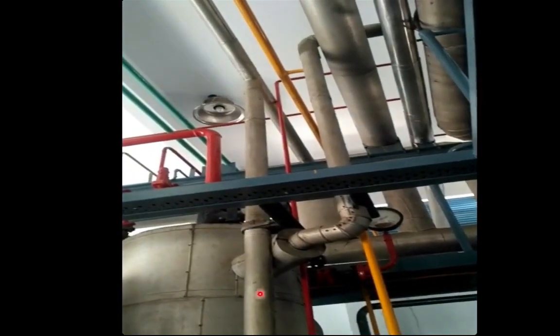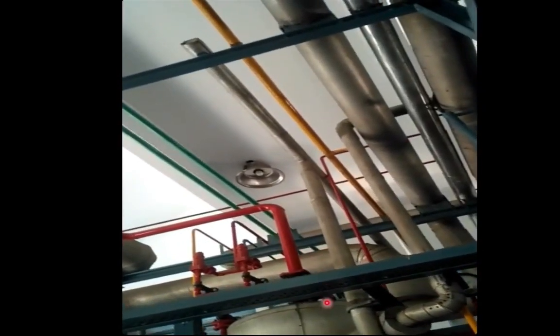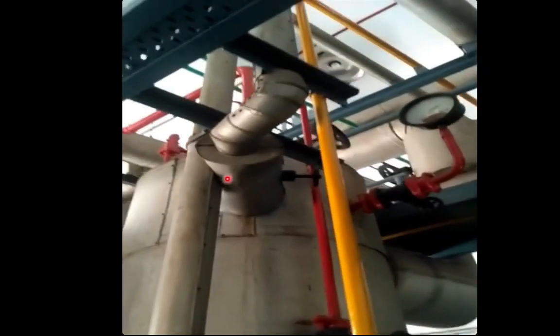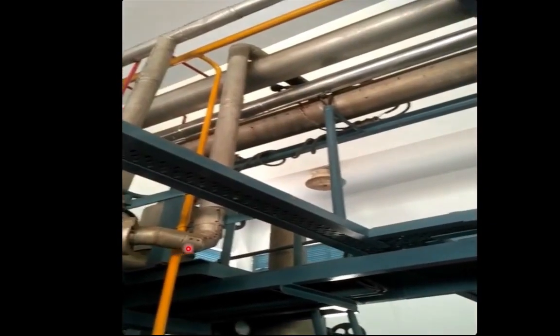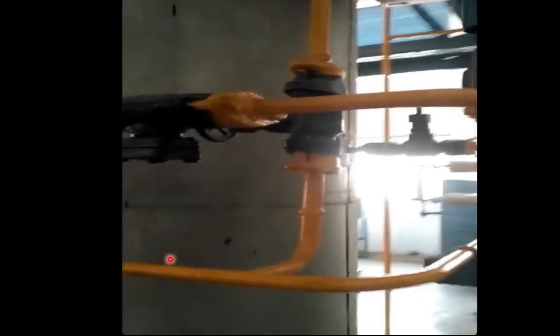This was for sub-cooling of the ammonia. This line incoming from the booster compressor — the ammonia here will also need to be cooled so that it can go to the next compression cycle with reduced temperature. This particular line is going to the connection which will finally go to the main compressor.